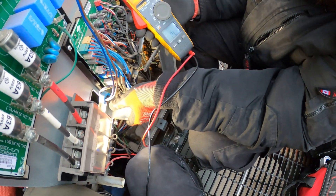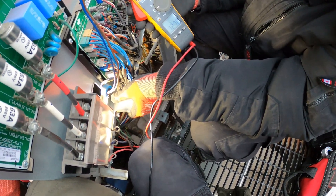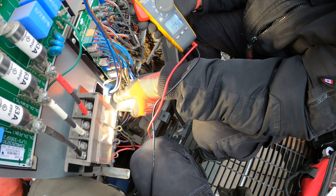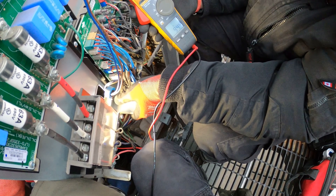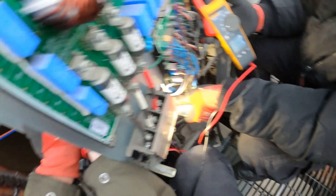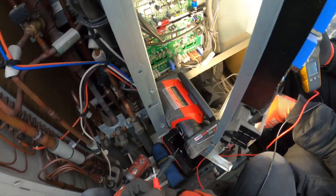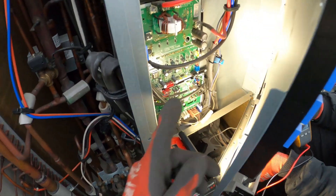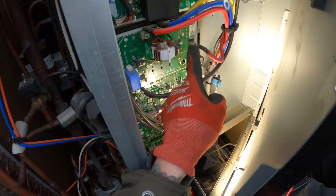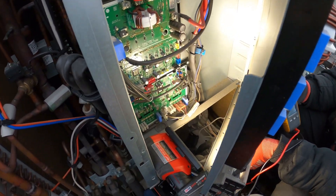We're supposed to read above 10 kilo-ohms. Look, it's going down — got below a thousand. It's supposed to read above 10 kilo-ohms; we got 925 ohms and dropping. Right away, that's bad. But I want to do the complete check on this board. I can see something is up here — I've never seen that kind of stain before.